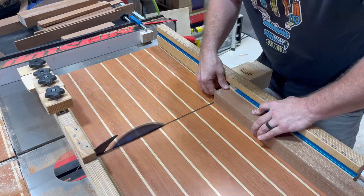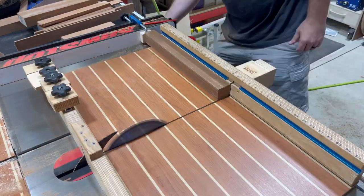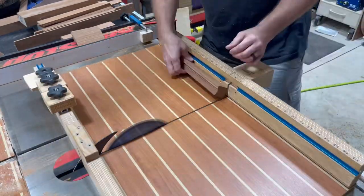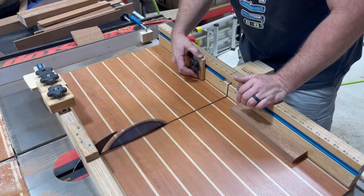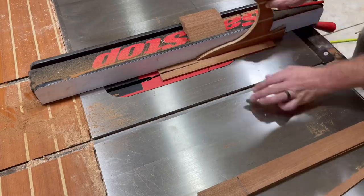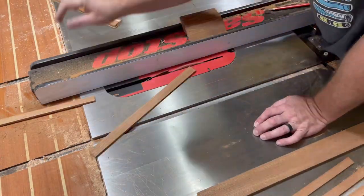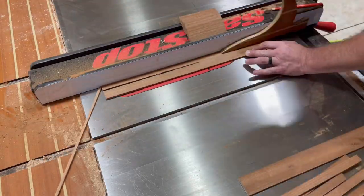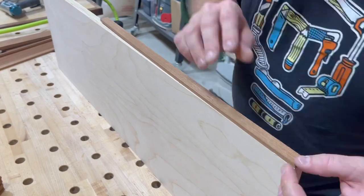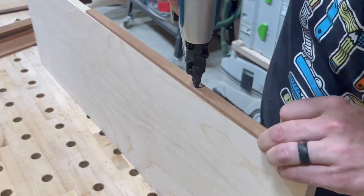Once you get everything cut, I'm going to cut these down to four specific lengths. I've got my table saw sled set up with a stop block and various systems to make sure these cuts are going to be repeatable and accurate. Then I'm going to take some of those pieces and rip them to three quarters of an inch on the table saw. I'll take this eight quarter stock and rip it down twice to give me long strips that I'll then pin nail with glue to the edge of this three quarter inch plywood.